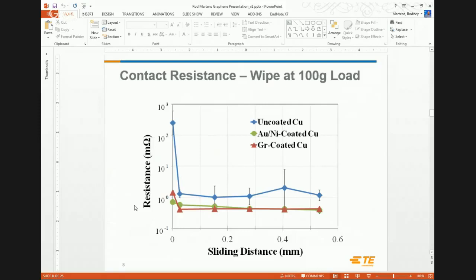Looking at results: the blue curve, slightly higher in contact resistance, is the uncoated copper. The red is the graphene-coated copper, behaving similarly to our gold-coated control coupon — very interesting. The horizontal axis is increasing load from 1 gram up to 100 grams. We then introduced a little wipe or translation at the contact interface to simulate plugging or unplugging a connector, displacing oxides or corrosion. In all cases, a little bit of wipe helped quite a bit — the blue uncoated copper was displaced down to similar levels as the red and green controls.